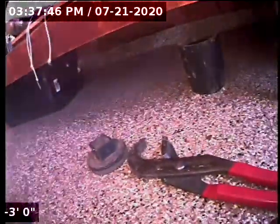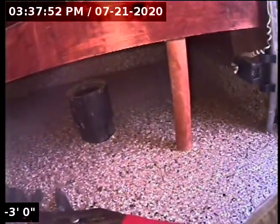Today we're at 8515 North Exeter Avenue here in Portland. We are located inside the garage. Right at the front right corner under the workbench here, we have a 3-inch ABS cleanout. We're going to insert the camera and check the overall condition and serviceability of the sanitary sewer line.